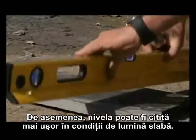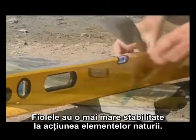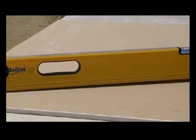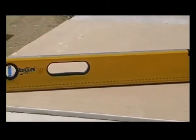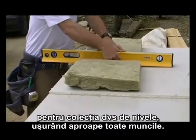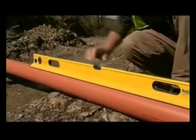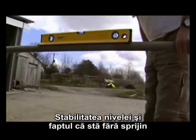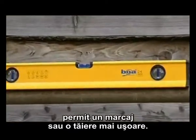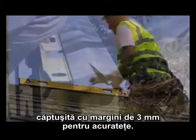The encased vials also make the level easier to read in poor light, and provide better stability against fading from ozone and other elements. This professional level is a great addition to the regular toolbox with features the professional user will immediately identify with. It's like a second pair of hands, making jobs such as door frames simple. The stability of the level and the fact that it's free-standing on pipes, ridge tiles, kerb and coping stones means it can also be used for cutting or marking.